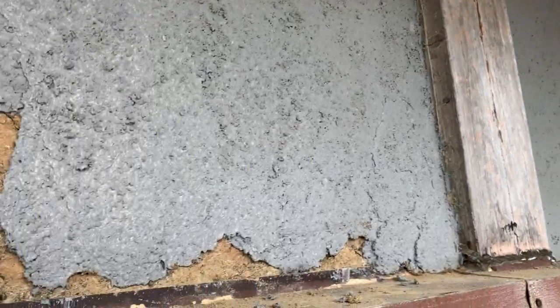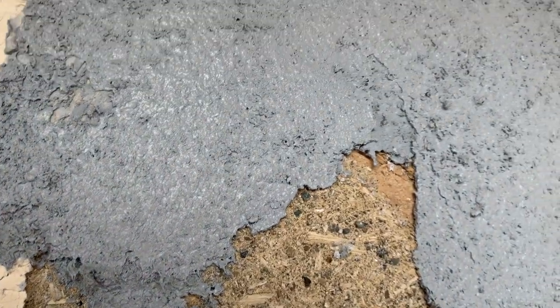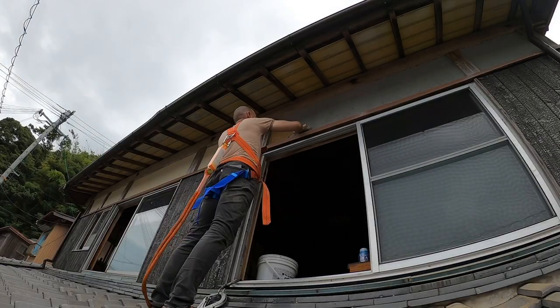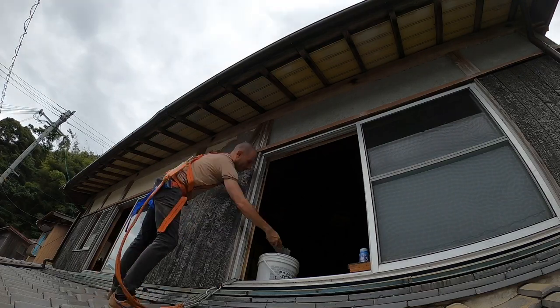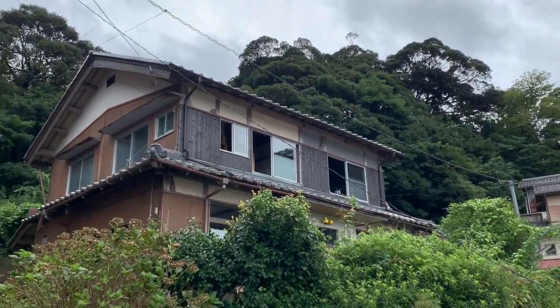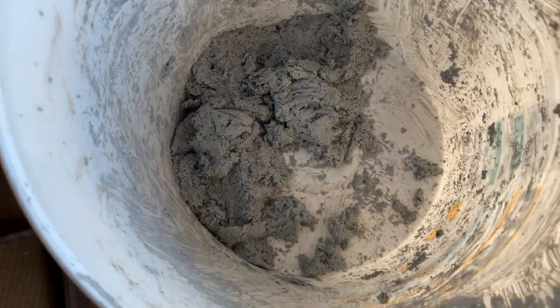Back to the stucco — it was like chunky peanut butter on toast. It doesn't want to hold on to the toast unless you apply a good amount of pressure. After that it grabbed on just nicely. It's a heavy material, so be prepared for your arms to get tired. The area that went over the wood had a different look and cured differently. I'll go over it later with more stucco material — I saved a little just for that.